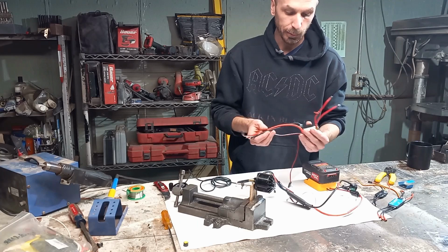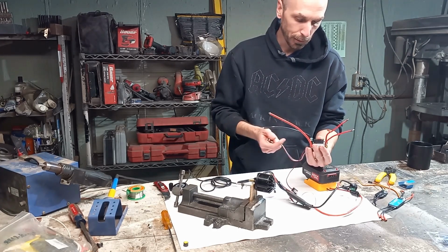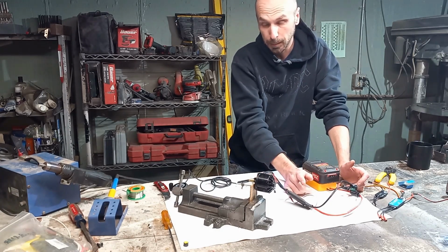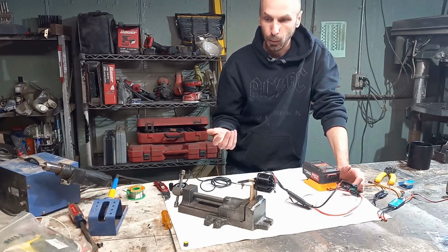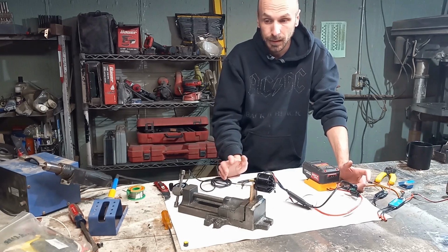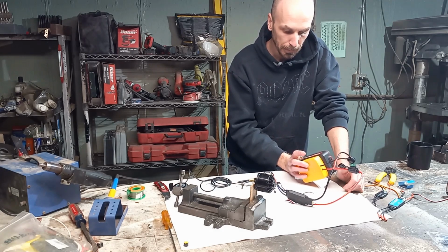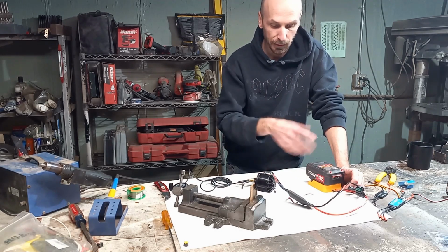Then I tried this car ESC, and this one just started melting as soon as I plugged in the battery. So I can't tell you about that one, because it was just junk to begin with. As for battery sizes, this one is 2-6S in LiPo, which basically just means S is 3.7 volts. So a 1S is 3.7 volts, 4S is 14.8 volts, and 6S is 22.2 volts. So this one will run between 2 and 6S on a LiPo setup. We're just using our 20 volt Bauer battery pack as our supply, and really you can use any of the batteries that fall in that range.